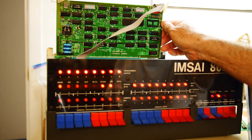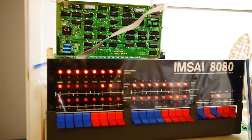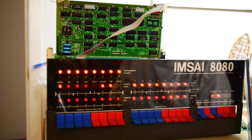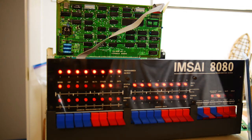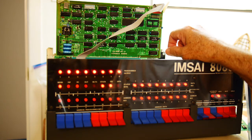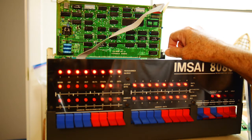It's interesting that we don't have those resistors on the board - they do generate some voltages but obviously they're not used. So it begs the question: why did they have them there in the first place? I have to dig into that - it's a bit curious. I don't think the PROM needs it; I think it's five-volt only. Nothing else on the board seems to need it either. It's a mystery - let's look at the schematic.